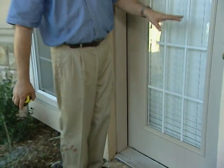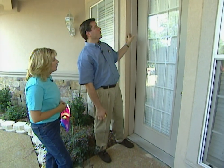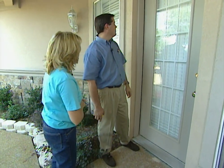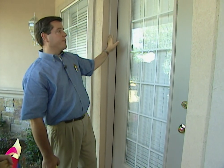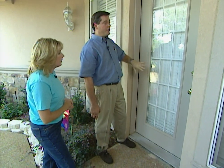How do you decide where to mount the screens? The mounting options — like in this door, we mount it on the door facing. We want it to look the best for the door so it blends in with the design. With the stucco coming up to the door jamb, this will just be mounted on the door jamb facing. If the home had bricks and brick molding, that's another option and we can go out on the brick molding.